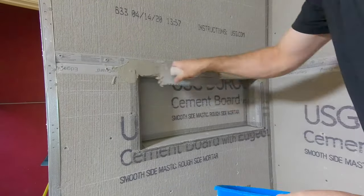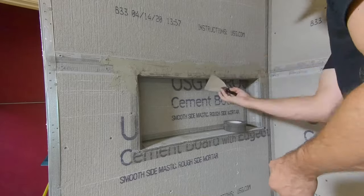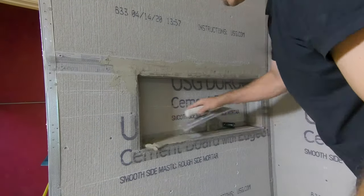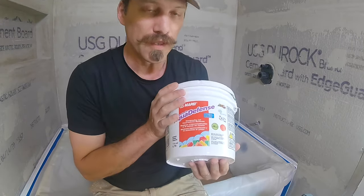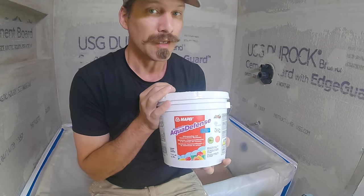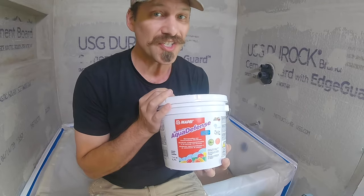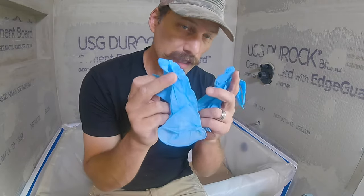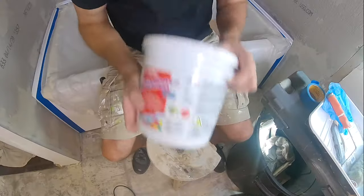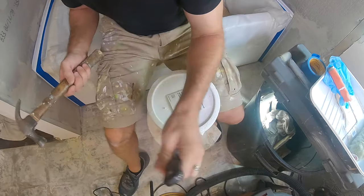I got this at the local warehouse — it's readily available, right by the Durock board. I'm going to mix in some mortar, seal up my joints on the concrete board — get it nice and peanut-buttery and slap it on the wall. As always, put the water in first and then the powder, both for mortar and for grout. Open a window, crank a fan, and get those fumes out of there.